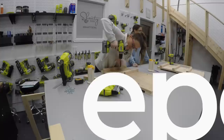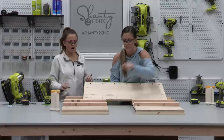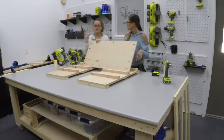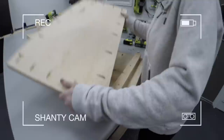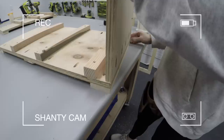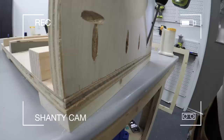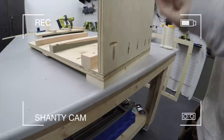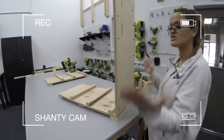We have both sides done with cleats on each side of the inside. It's time to attach the base piece — that is also a three quarter inch sheet of plywood with three quarter inch pocket holes drilled all around the edges. Adding a line of wood glue, lining up the base flush all around including the bottom, and using those same pocket hole screws. I've got that side attached — now I'm going to flip it over and attach the other side.